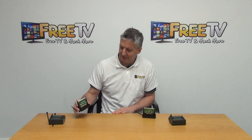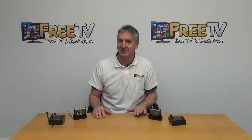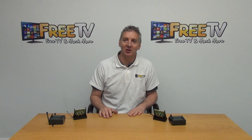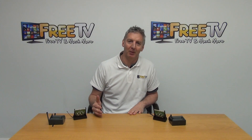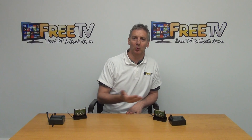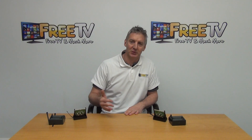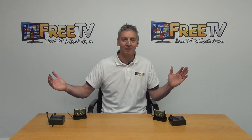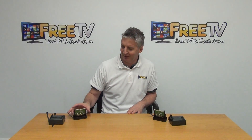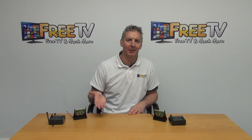One final thing: these types of setups work quite well, but the scenario where they won't work for you is if both the Freeview and the Saorview are using the same range of frequencies. Then you're into a problem, because you can't join two signals together that have an overlap in frequency — it's either input one or input two, and there's a range on it. There's a logic behind how it works. The lucky thing is that in most scenarios there is a workaround where you'll be able to get both Freeview and Saorview together on a single cable, possibly because there's some level of coordination between Freeview and Saorview.